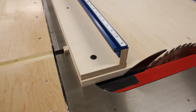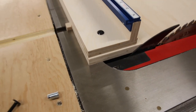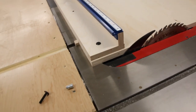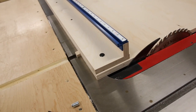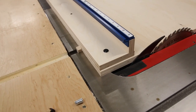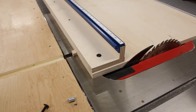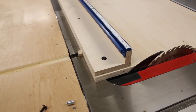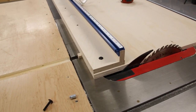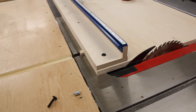So then what I've done is I've put the fence flush to my plywood here, and I've made the cut using a five cut method. I used a piece of plywood that was about 24 inches by 24 inches. And then I was out by about 30 thousandths of an inch over a length of 24 inches. But when you use a five cut method, it compounds the cut. So even though I was out 30 thousandths of an inch, I was actually out four times less than that,